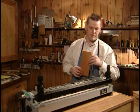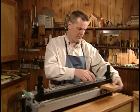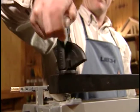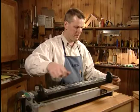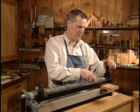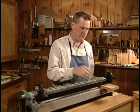On narrow boards, the clamp at the free end should be taken down a couple of extra turns. The bar should bow down slightly at the free end for secure clamping. For all but the wider boards, you need only operate the clamp on the board end.